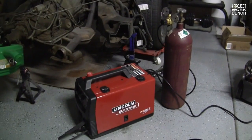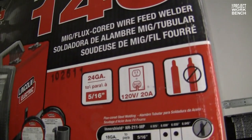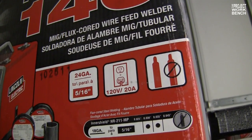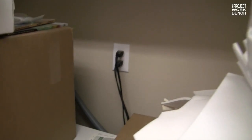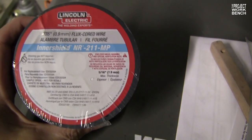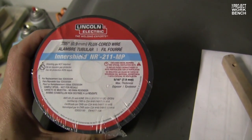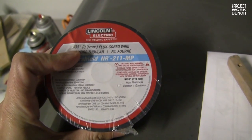Today was not as productive as it could have been, and I think it's largely the fault of the welding machine. One thing we should have paid attention to: the welder requires 120 volts at 20 amps, but we originally had it plugged into the wall which was only set for 15 amps, so we ended up plugging it into the laundry outlet. The other mistake: the flux core wire is 0.035 and the regular wire is 0.020, but Bo was using the tip for 0.035 — so we need to switch the tip out for 0.020.